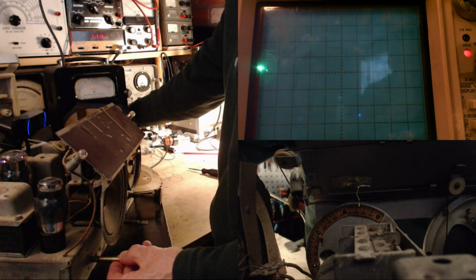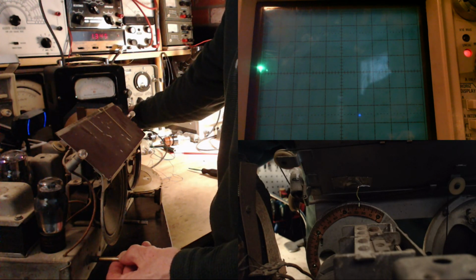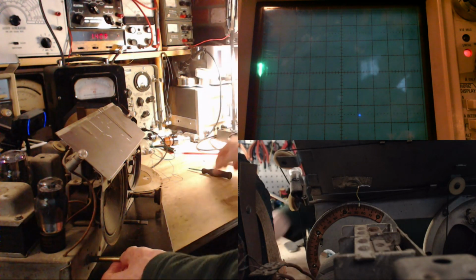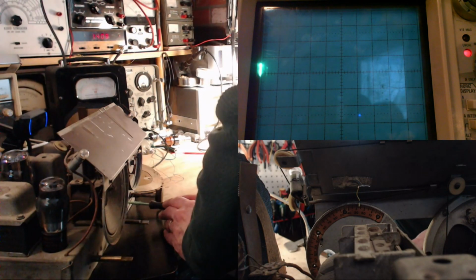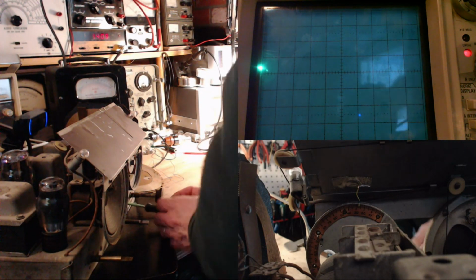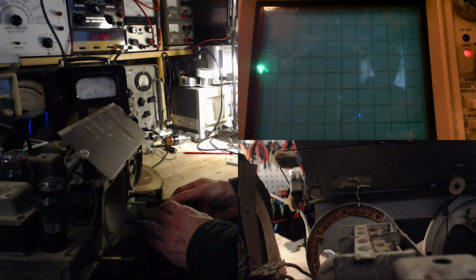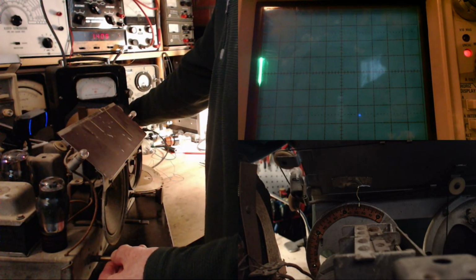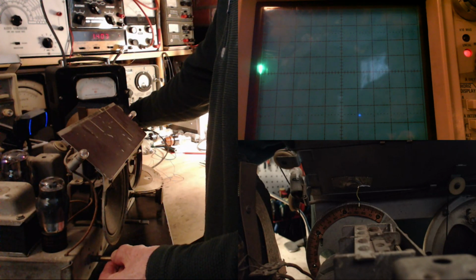Anything else coming through? Now that could be an image. There's something at 1320. Bunch of stuff here and there. Ooh, it's not very good. And there's the 14. I think this radio's wrong. I'm going to leave it at 14 and I'm going to turn this. This is the local oscillator. I'll try to get that strong one in there. Well, that's pretty strong right there. I just barely moved it. What do we got happening now? Now we've got the radio. Really coming up nice at 14.